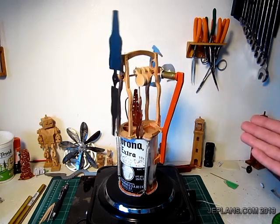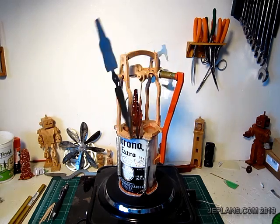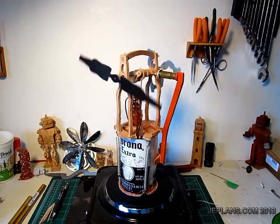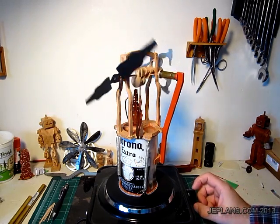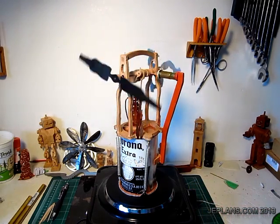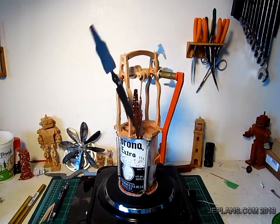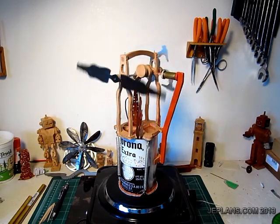It actually didn't perform quite as well as the bellow did, to my surprise. In an effort to increase its operational range to a lower temperature, I've increased the travel of the displacer. To give it a little more torque, I've increased the throw of the piston arm of the crankshaft as well. It hasn't helped a lot. It performs alright at higher temperatures. I also increased the diameter of the displacer, but unfortunately sometimes it actually sucks over and blocks the exit hole of the air. So if you get too much of a temperature differential, it's blocking it - so that's not good either.